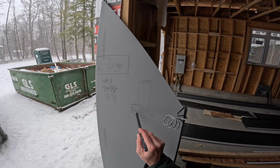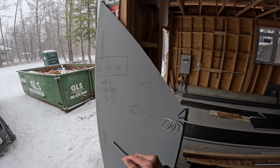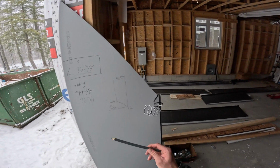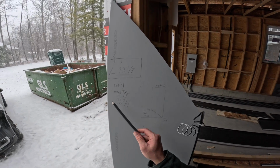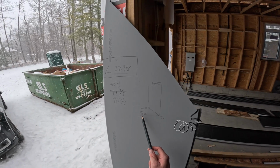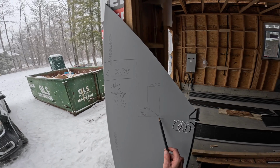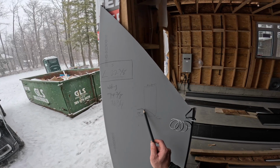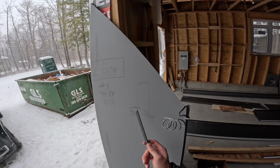And this is a lot easier to adjust than getting a protractor out and changing the degrees of an angle. All you need is a tape, and you can shout up to the guy, we need to shorten the step 3/8 of an inch, so that would bring this heel down. If I shorten it up to change the angle, or I need to add an 1/8 to the step.